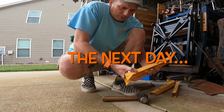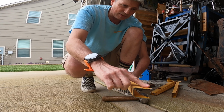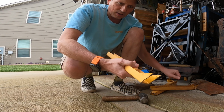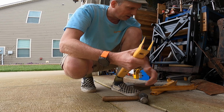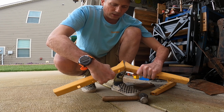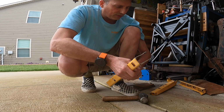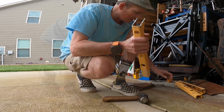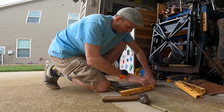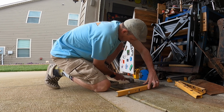So these legs that I'm going to be using, if you can see it, one side has a divot to where they would mesh together, so the steel's not flat here, and that means it won't line up when I go to weld it. So to make it line up, I have to smash that flat. I've already done it on these through various trial and error methods. What I found worked was just to stack up steel in between.